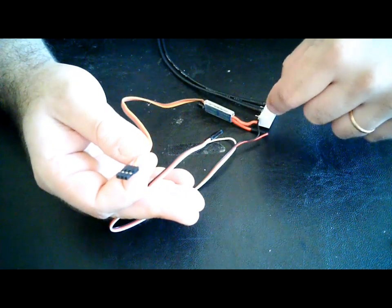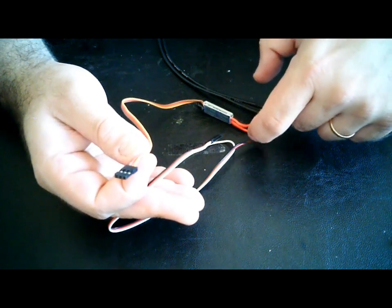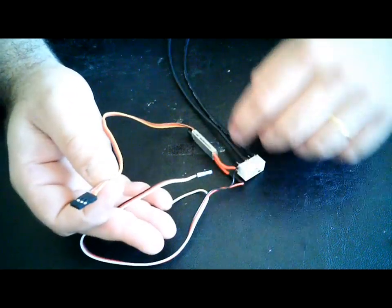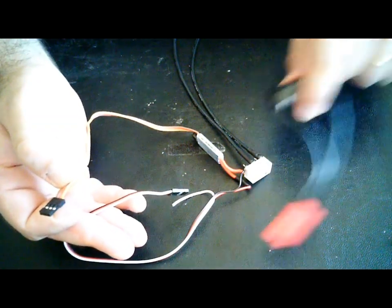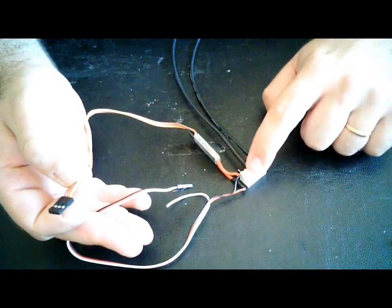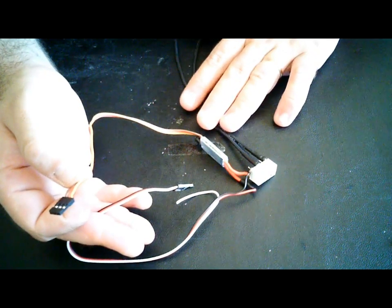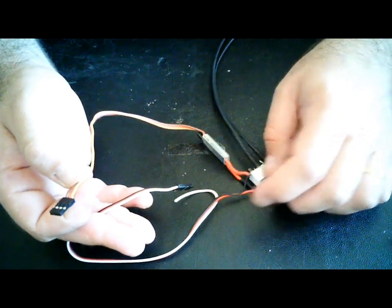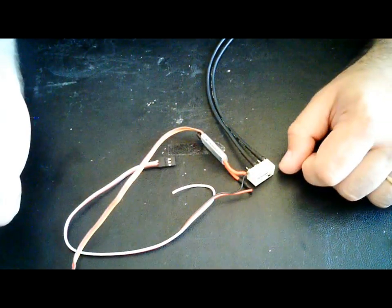Now, why do you use a relay? Simple. Because if you use this power on this side, we would have 5 volts over here. And remember, for your glow plug, you only want 1.2 volts, like this sub-C cell, 1.2 volts. So now, you have a separate, independent circuit over here that's going to close or open the relay with this switch in order to have a 1.2 volt battery over here. So you have 1.2 volts over here and 5 volts over here. That's what's going to activate the relay. And this is all there is to it.